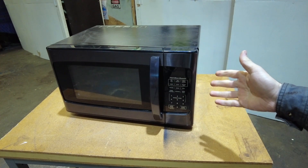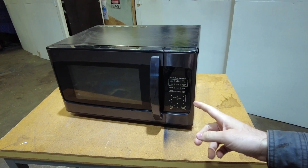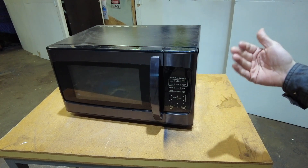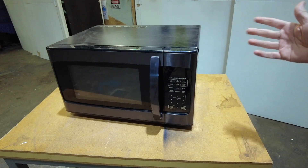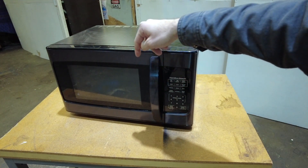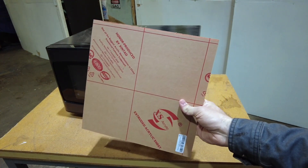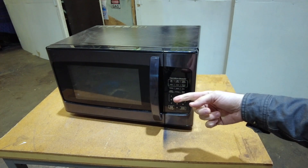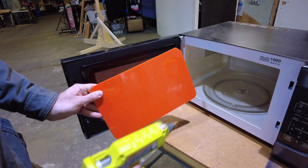That's pretty much all there is to it. The machine is functional, I put it all back together and tested it — it works great. But there is one more thing I want to do. The UV light I put in this thing, it's not really great to look at with unprotected eyes. You can for a while, but it could lead to vision damage later on if you were to look at it repeatedly for a long time. I could just spray paint over the window so you can't see the light at all, but I kind of like watching the little parts going around on the turntable. So I went out and bought a sheet of UV resistant acrylic, and I'm just going to cut it down and glue it right over the inside of the window so we can still see what's going on in there, but it'll cut down on some of the harmful UV. To attach this into the door, I'm just going to use a little hot glue.